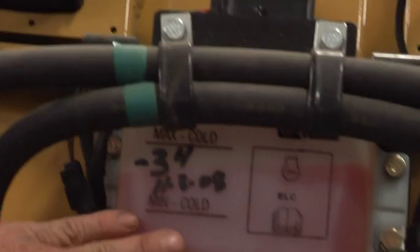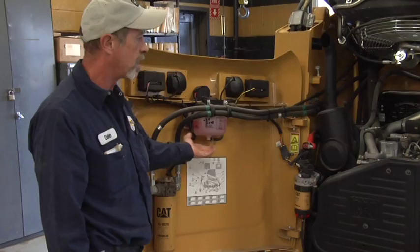Check your coolant and make sure your coolant's good. Come fall time, you want protection to at least 25 below zero. Once that's done, we're in good shape.